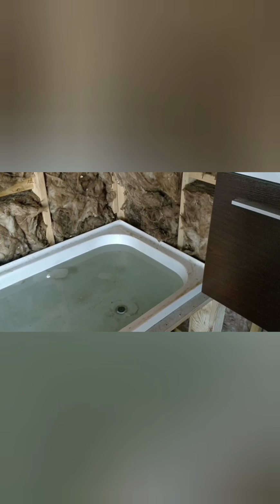So up until now I've just been flushing with a bucket of water. I'm just waiting until I sheet that wall and hang the cistern, so we can be a little more civilized. The bath's just got some cold water in at the moment because I have just done the foam underneath it at the front. The bath's actually set in mortar, but because I was waiting on plumbers, I didn't actually do the last third at the front. So the last third at the front is done with expanding foam. And there is another video where I did cock that job up, so watch that one if you're interested in doing it. Hint, that's why it's full of water, so that the expanding foam, as it expands, doesn't lift the bath out of the frame. So I learned that one the hard way.